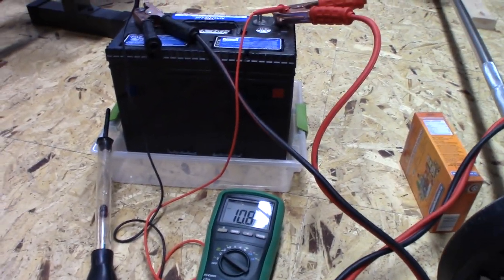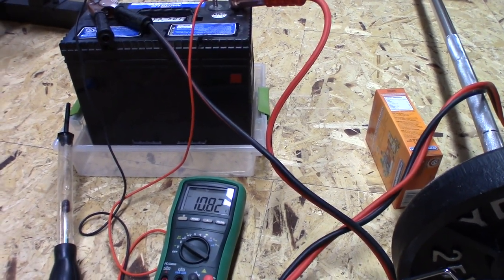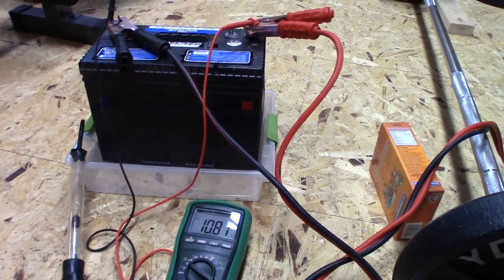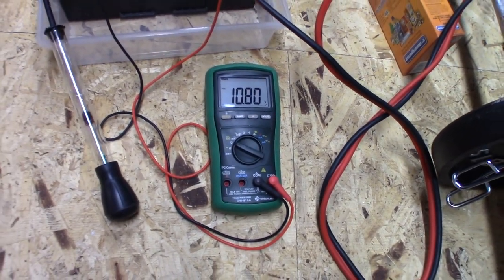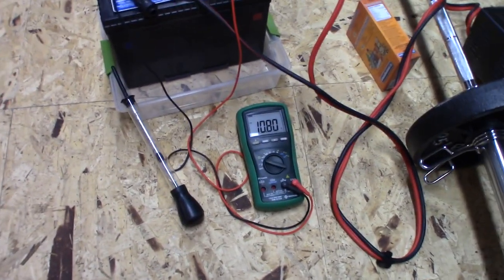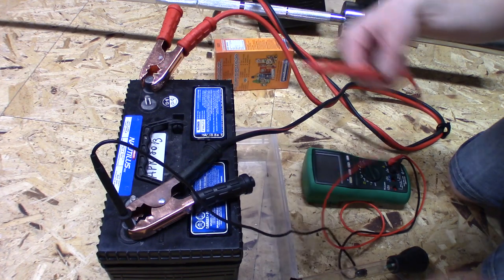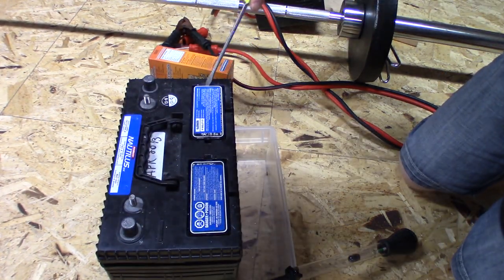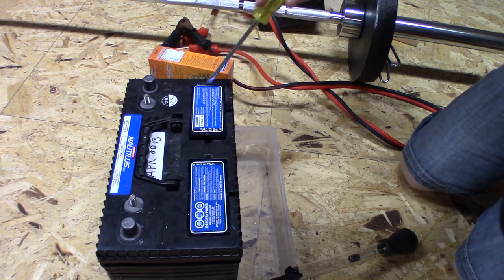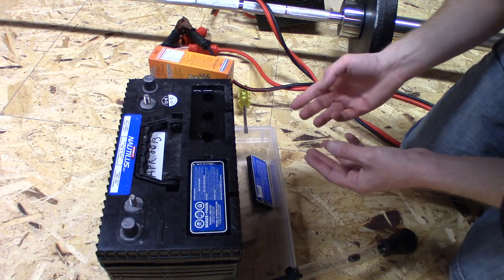When I was putting my finger across the cells I could feel the ones that were warm. The one at the end actually wasn't that warm, though heat will kind of transfer anyway. When I opened it up I was able to learn more. I'm going to open this up and show you my findings. The voltage is still dropping — it's like 10.8. If I got a charger optimized for a 10 volt battery I could probably keep using this battery, but I don't really have a use for it and I don't have a 10 volt charger. When I opened this battery yesterday I noticed the sulfur smell, because the cells were being overcharged so much they were really gassing quite a lot.